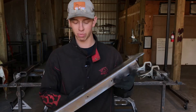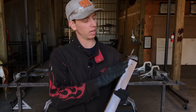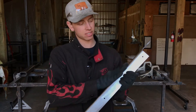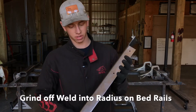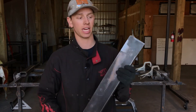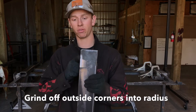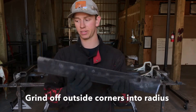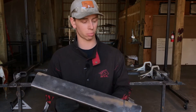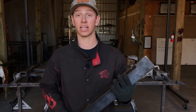As you can see here, I got my finished bed rail — you should have two of these. I solid welded this junction here so you got your two pieces at a 90, and then I ground this off into a nice radius. If you want to do that, go ahead. If you got a beautiful weld right here that you want to leave, also totally fine. Another thing to make these look more professional and also be safer is to round off the outside corners — I rounded off both of these, gives it a nice finished look.